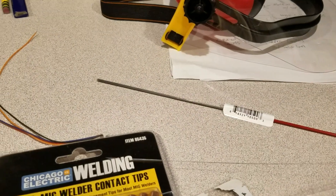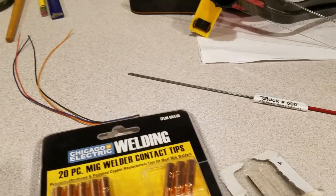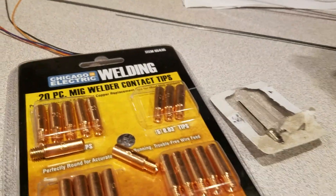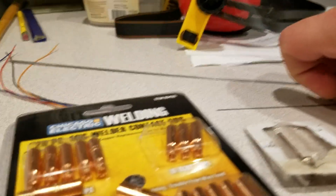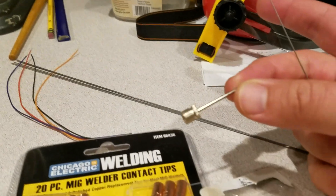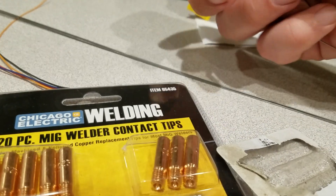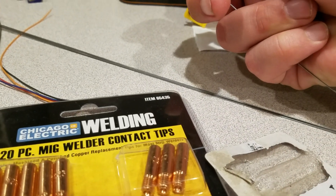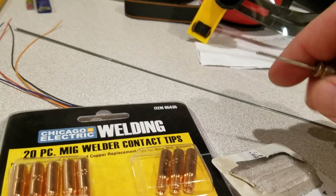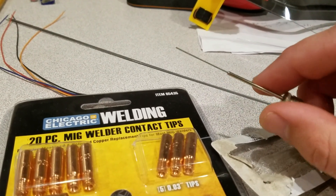I'm possibly going to the really thin 0.015 wire. It's so thin I'm not convinced that's going to do a good job, but at least one person's using it and it seems to work well. Here's the 0.025 which is the suggested wire to start with. I'm currently using one of these inflation needles as my tip, and if I put the inflation needle on here — kind of tricky to do one-handed — it's really wobbly on there, it can really shift around.